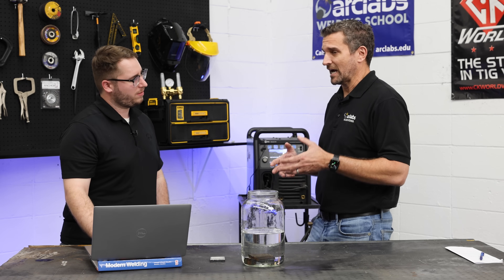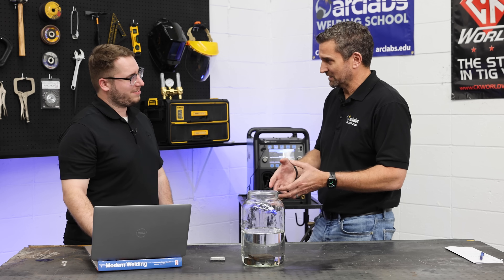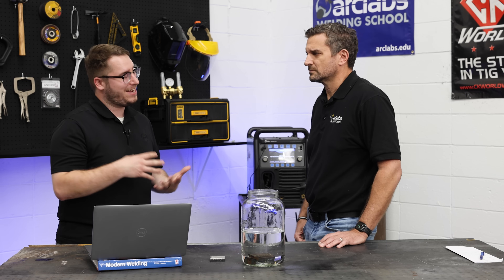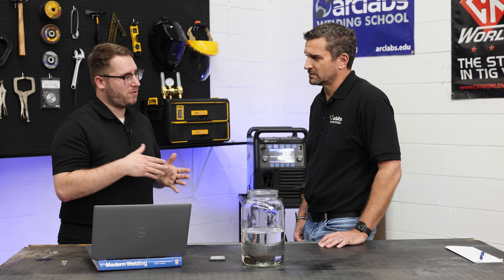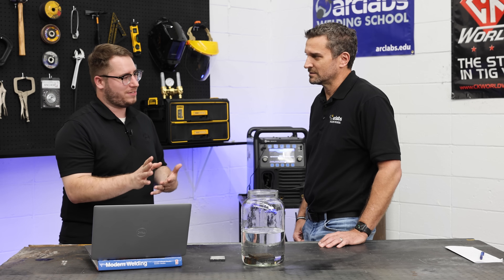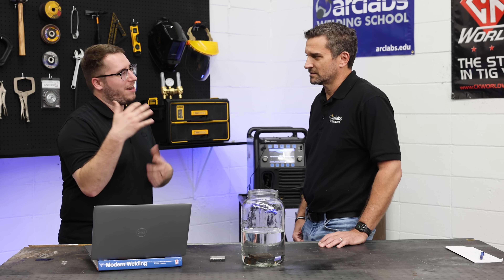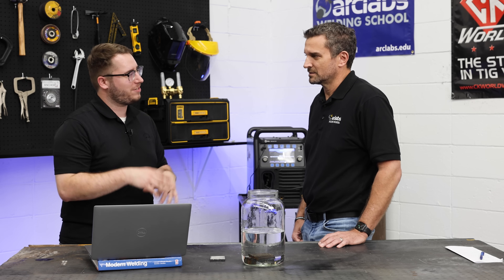It's not obvious that hydrogen can get into a solid piece of metal — hydrogen is a gas, so how does that happen? When we're welding, we're melting steel, taking a solid and putting it into a liquid state. During that welding process, hydrogen from the air, from our electrode, and from the atmosphere can diffuse into that weld metal. Hydrogen is the smallest atom — it has a tendency to diffuse into molten steel and form along the grain boundaries. Once that steel solidifies, that hydrogen has to go somewhere, and it's trying to get out of the now solid steel. In certain circumstances with the right conditions, it can cause a crack. We did a demonstration that proves the gas can actually get into the metal.